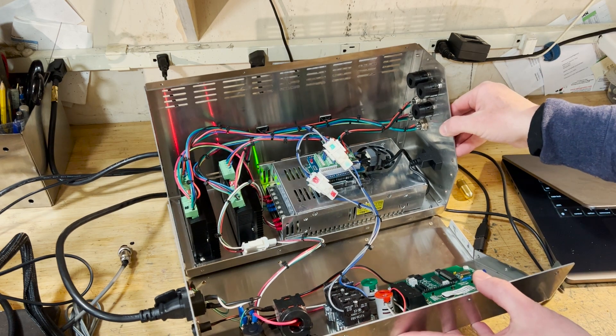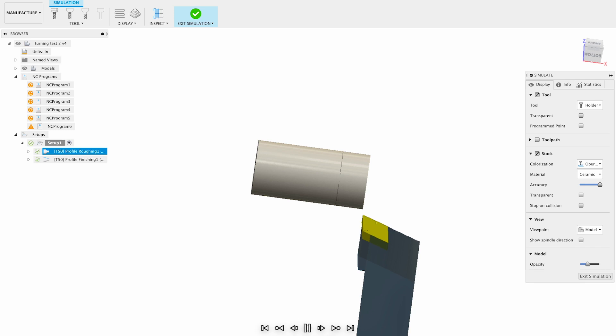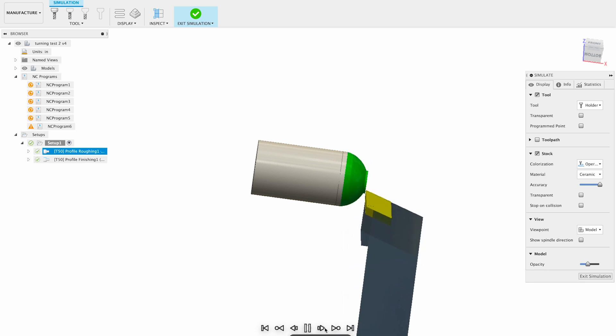There you can see the box formed up and made. Inside you get a picture of how it made really nice work of it with those two tools. Inside you can see the power supply, the two controllers, and the Arduino on top. Now that I had it all put together, I had to see — can I get the G-code? Here's Fusion 360 putting in a program that I wanted to test.